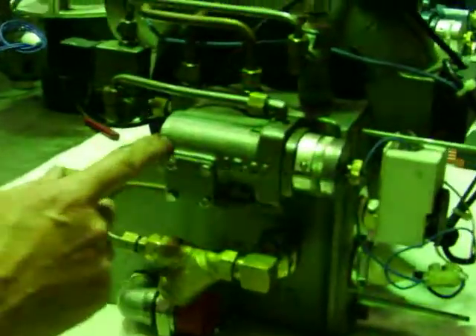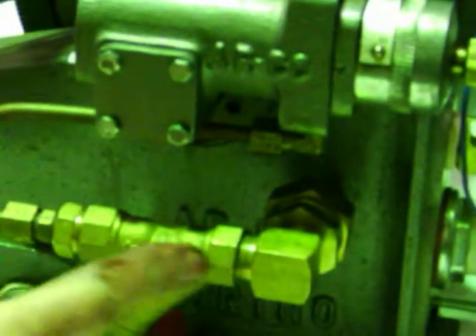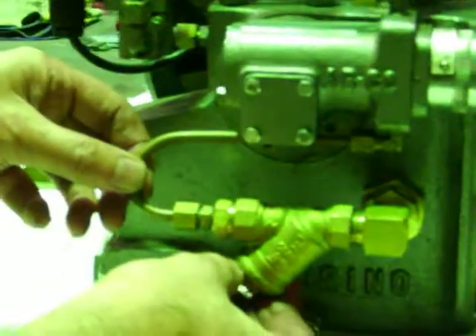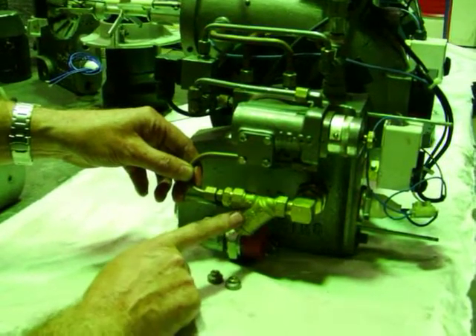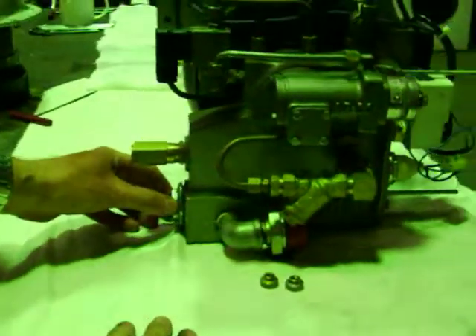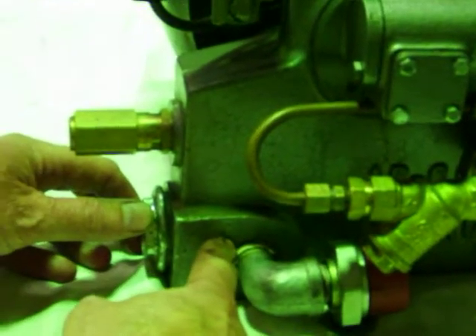Just under the silver wheel here is a Y strainer or Y filter that we add at the factory. This draws hot oil in from the pre-heat chamber, and that oil is drawn through and up via a little pump hidden inside this housing. That wire strainer has to be cleaned and examined periodically. We'd recommend when you get a new burner gun to check it after two to four weeks. There's also another filter here — the major oil input strainer. This half-inch to one-inch fitting is where the waste oil comes in gravity-fed into the pre-heat chamber as our oil supply, running through a coarse strainer.